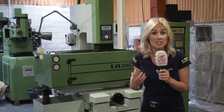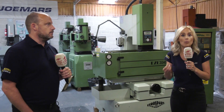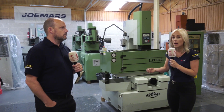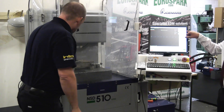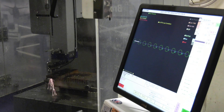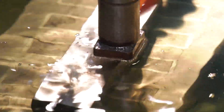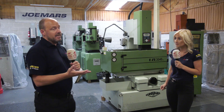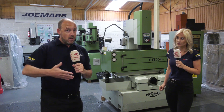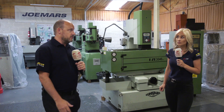Thank you for watching the show today. The essence of today's show, particularly in the current climate, is about cost and making sure you are getting best value for money. Maybe you subcontracted this work out before and might be considering bringing it in-house. The four points touched on were: solving problems — drilling deep holes, very small diameter holes with EDM drills, using manual spark machines when CNC isn't needed, achieving square edges and difficult profiles in harder materials, all operations that can't be done as well on machining centres. The cost is up to 20% less than some of the competition. Why buy a machine that does things you don't need it to do? Buy one that does what you need.